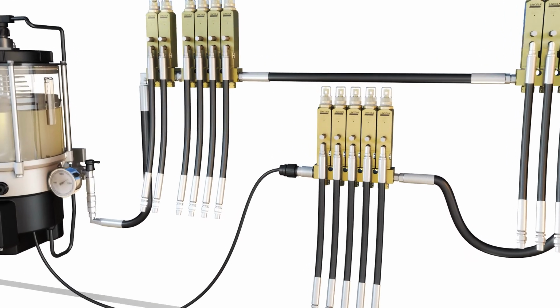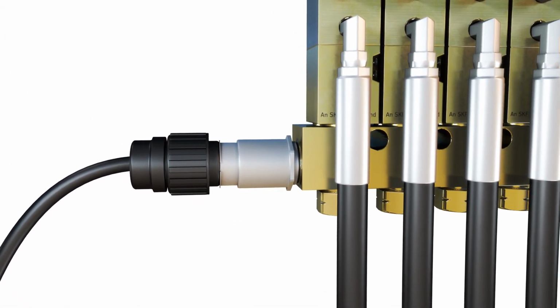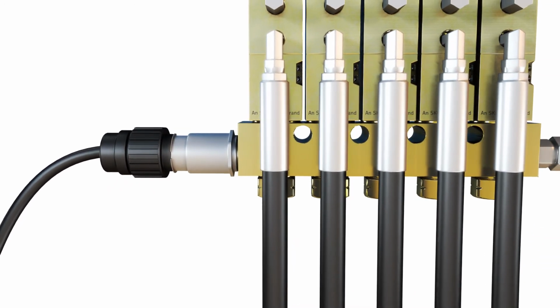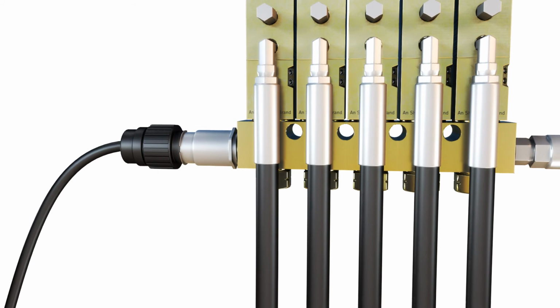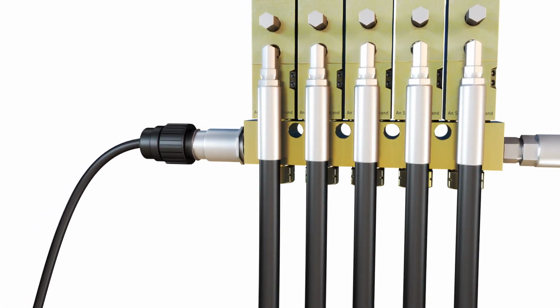An additional pressure switch or transducer can be added to the end of the system's supply line for larger applications requiring up to 75 feet of 1/4-inch supply line. Monitoring at both ends of a larger system ensures all injectors dispense during the lube event.